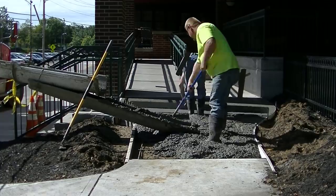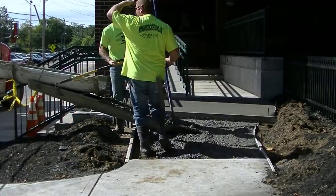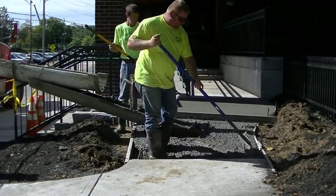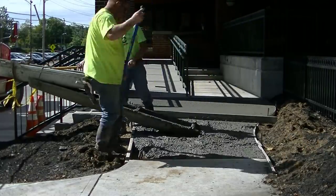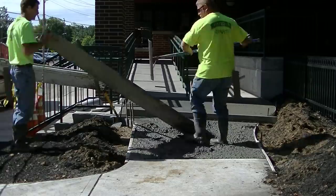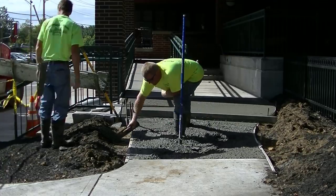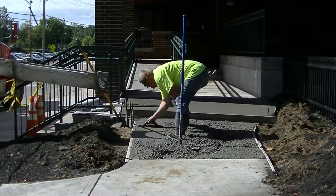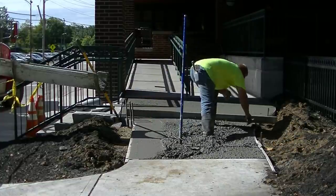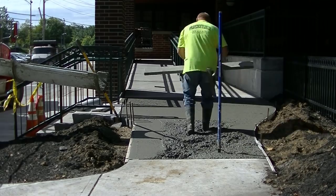As you can see, we've got it poured out, our edges mag floated, and we're just starting to screed it down. We had a 10-foot screed to start, now I'm using about an 8-foot screed and getting it leveled. You can see it kind of pitches towards the right and also towards the front, away from the building — so it's got a couple different slopes. We did a bunch of sidewalks and some steps right there. Luke's going to finish mag floating those edges — we like to mag float our edges because it makes them nice and smooth, pushes down the rocks, brings up the cream, and helps when we go to finish.